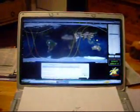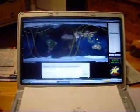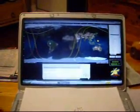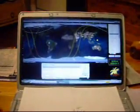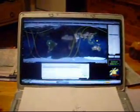It will predict the passes for you for any particular satellite. It will show you the radio frequencies and what modes you need to operate, and it will also tell you about Doppler shifting — it will show you the frequency that will vary based on the position of the satellite.